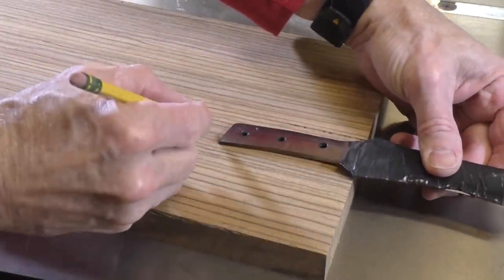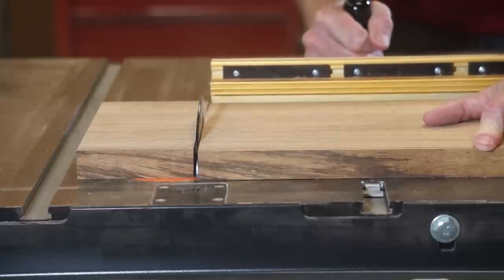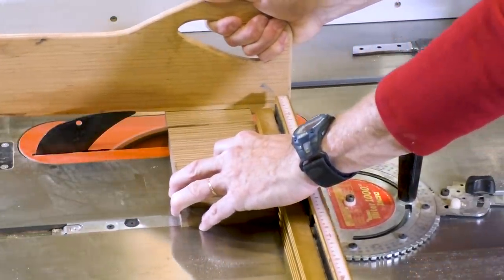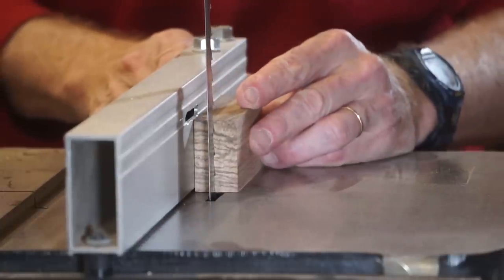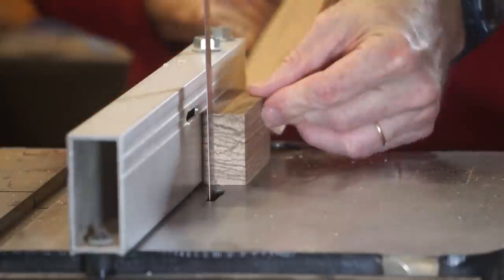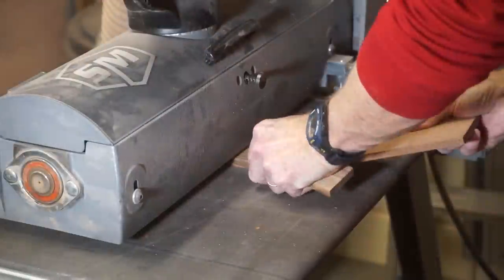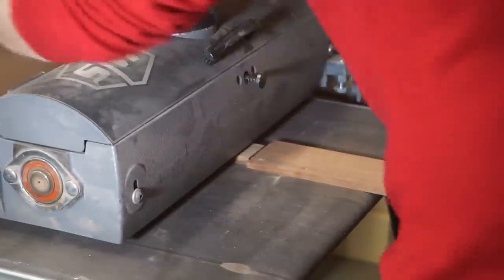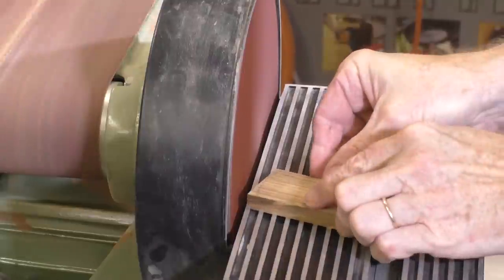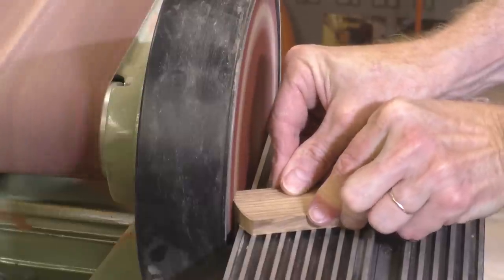Now I'm marking the length of the scales and then I will cut that piece on the table saw. Over at the bandsaw I just eyeballed it to split the piece of zebra wood down the middle, and I think it came pretty close. After that I ran them through the drum sander. If you don't have a drum sander, there are lots of different ways to sand down the wood to make it flat. After sanding the tang with the disc sander, it made a little bit of a curve in the steel near the blade, so I had to adjust the pieces of wood so that they will fit closely inside that curve.